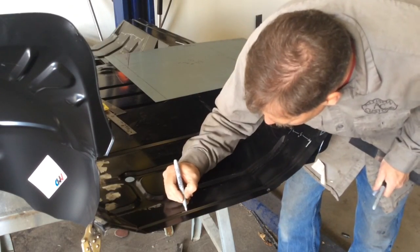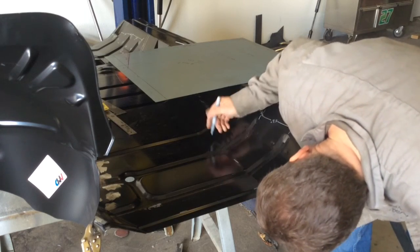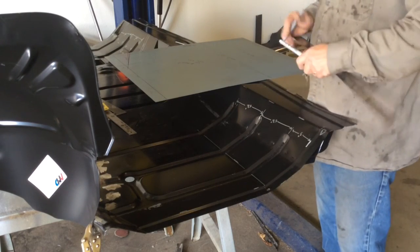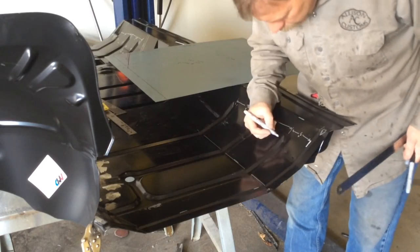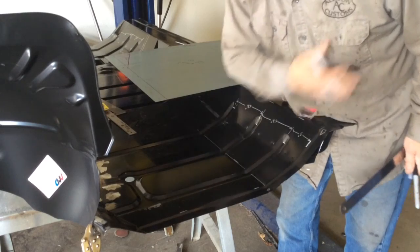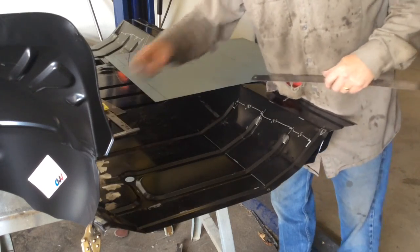So we're going to work from the top of this bend, in the middle of this bend for any measurements. Measure from this bend up here down to those. So we need to know where this line is, because that's where the die stops and it's rolling. This other part is just as the die is approaching it. And then we'll need to know where the center of this and this is, so that we can get all of the angles on there, all of the ribs in there.